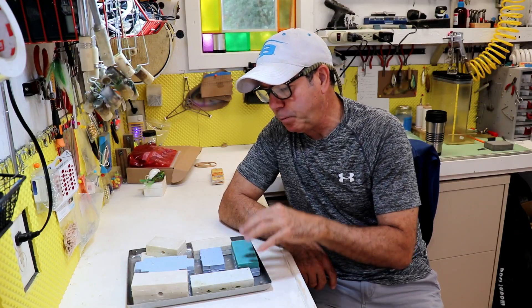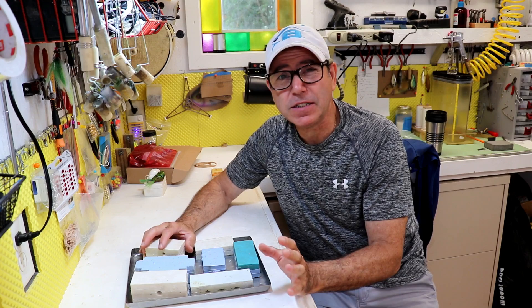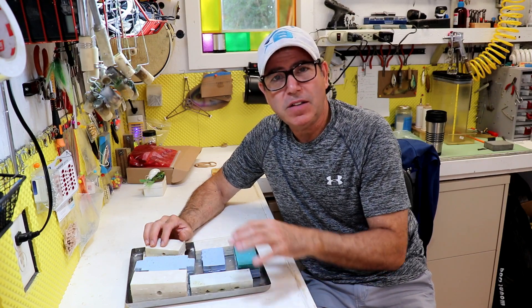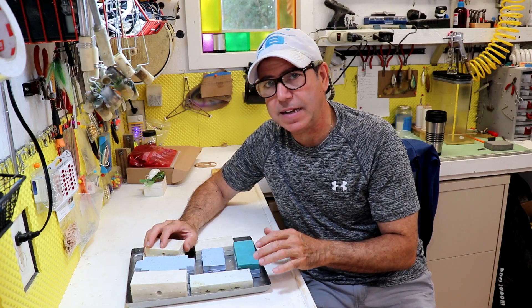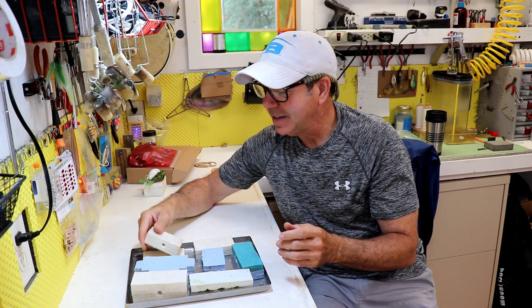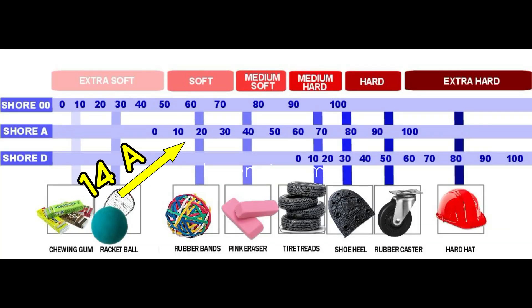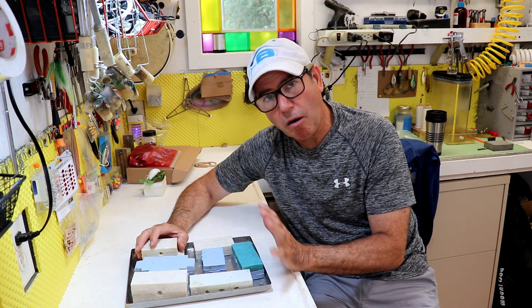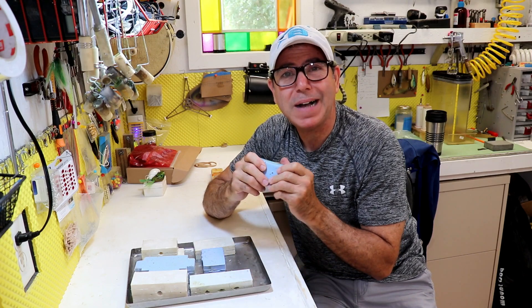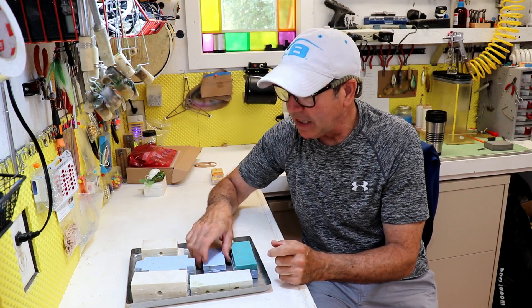Let's talk a little bit about planning your mold and the material you're going to use. I'm using silicone from Smooth-On. I've used a bunch of different manufacturers and I haven't really found any difference in durability. What really affects durability — how long your lure mold lasts — is the hardness of the material and how you actually cast it. Silicone is rated on the Shore hardness scale. What I've found to be the best for lure making is Shore 14A, which is sort of like rubber band hardness. I'll put a scale photo up so you can take a look. What happens when you go harder than 14A is the silicone becomes harder and less stretchy, less pliable, and is more apt to start to crack. So failure mode one is if your mold is too hard.